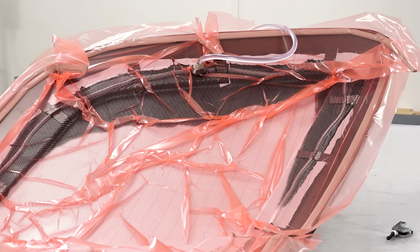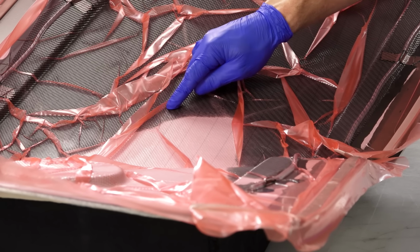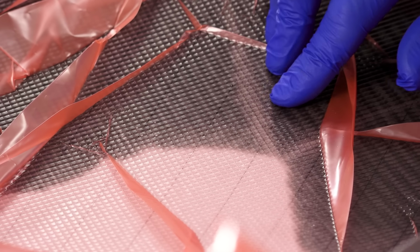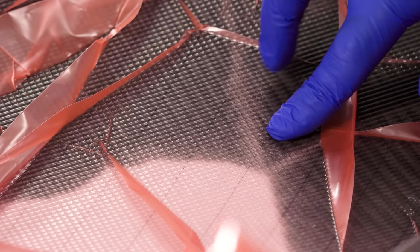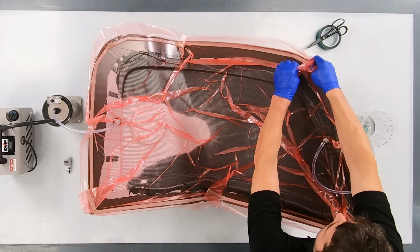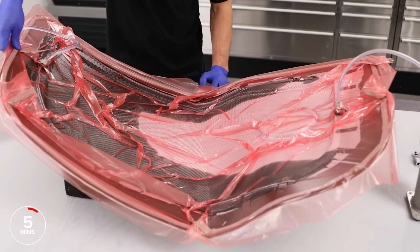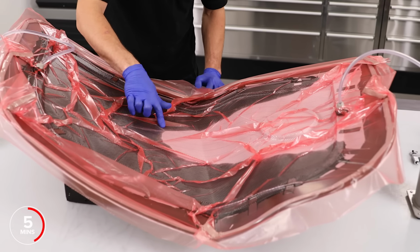You might notice some bubbles shooting forward at the flow front. These are not an indication of a leak, they're simply microscopic bubbles that were introduced during mixing that are now expanding massively when they're near full vacuum. It is possible to eliminate these by degassing the resin before infusing, but they don't really cause any problems in the part, so it's certainly not needed.